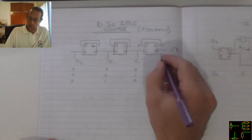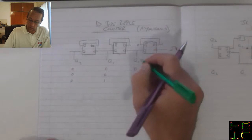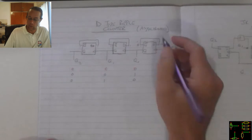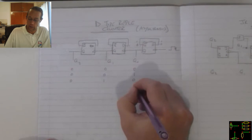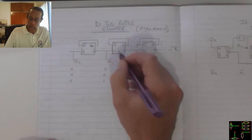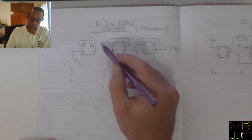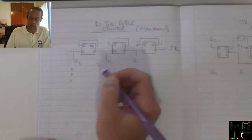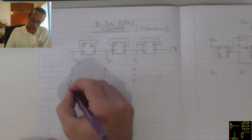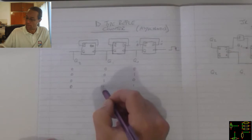With the next pulse, that was a 1 over there and as a result a 1 over there. With the next pulse, that 1 will move to the output. As that 1 moves through, that 1 will still stay 1 because it's looking for the lagging edge, and that one will then trigger high. This will still stay zero because it's looking for the drop.